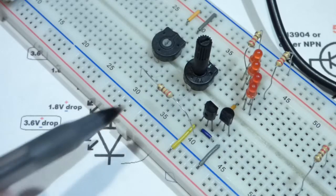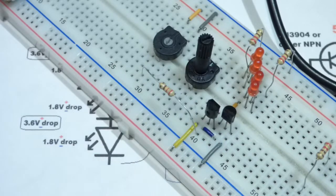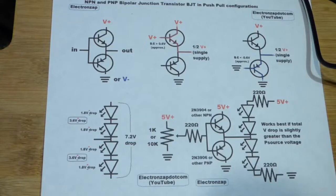The current from the trim pot goes through the base and emitter, which adds a tiny difference, but ultimately the voltage set at the base determines the voltage coming out of the transistor. It'll be the same voltage minus the 0.6V drop, because these are wired as emitter followers. If you look up emitter follower, you'll see the output voltage is controlled by the base voltage. Here is the full diagram — I'm going to try to show the whole diagram in my videos since a lot of people want it. There's the entire diagram. Thank you.